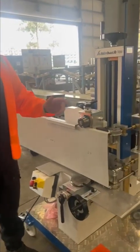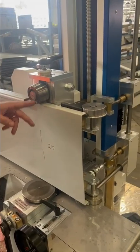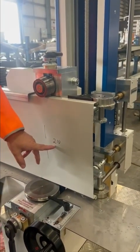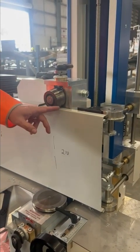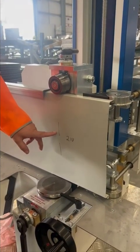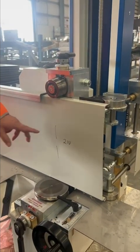The first thing, which is pretty obvious, is that from the center of this shaft to the center of that roll, the distance is 210 millimeters. Therefore this section will always be flat — it will never be arched. This 210 line is my goal position to start winding.